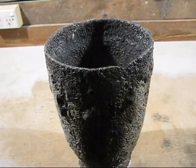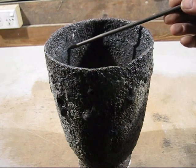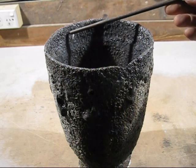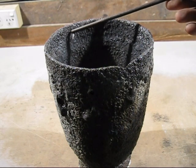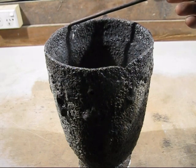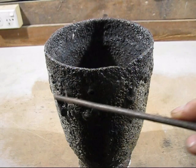Before I do that I'll explain a few points on how these crucibles tend to wear out. This is an A12 and I put in 14 kilograms of cast iron. You can see the level just there — that's where the level of the molten metal is when I've finished adding the 14 kilograms. The rest is the foam or the slag that foams up and it tends to come up to about here, and can also run over the edge.